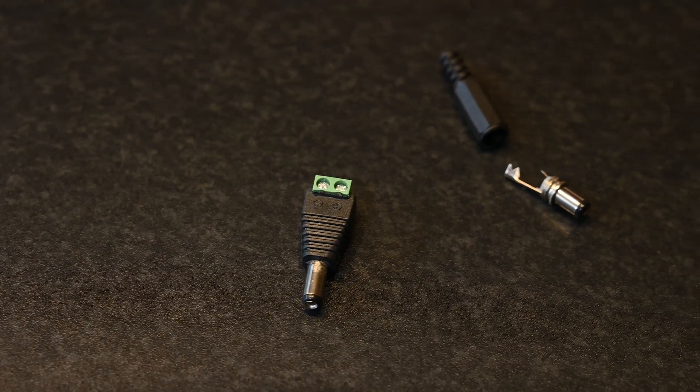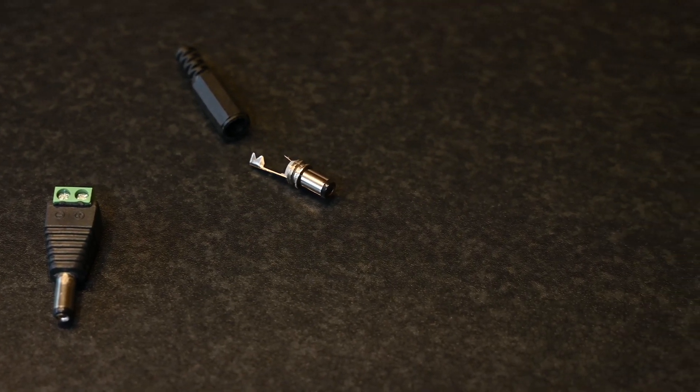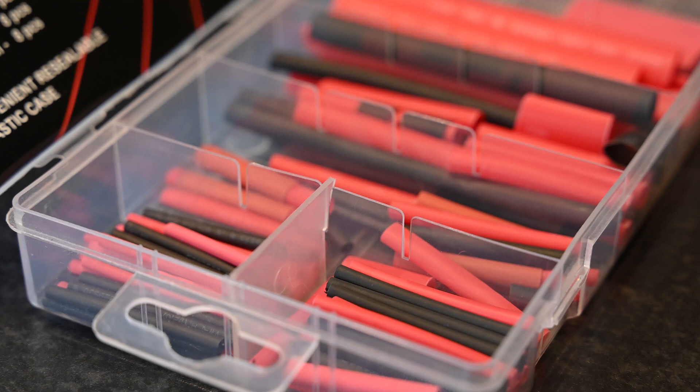When I cut my cables there's a simple solution: use these kind of connectors. These have simple sockets and you just tighten them down with a screwdriver, or you can use the connectors I use — simply unscrew them, thread them on the cable, solder the cable end, and then put it together. If you care about how things look, you can also sleeve the cables with these kinds of sleeves. You can buy these in different colors, lengths, and thicknesses. If you use these sleeves, make sure to also use shrink tubes, which are also available in different colors.